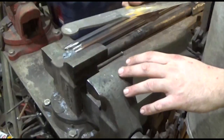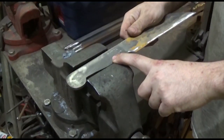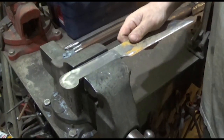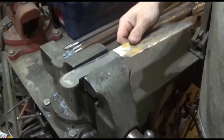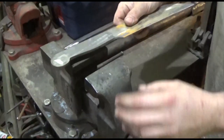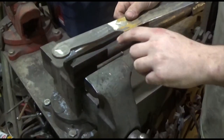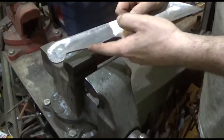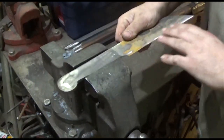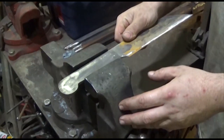What some knife makers do is they'll put a block of wood inside of a vise and then clamp the knife to that block of wood. Now obviously you can't just lock the tang in here because you're going to get all kinds of up and down wobble. And that's really the downfall, the only downfall, to a vise like this. Even if your jaws are perfectly parallel and they grip nice and tight, when you have something that's an odd shape that you want to apply downward pressure to, for example if you're sanding or filing, this type of a vise just isn't ideal for that.